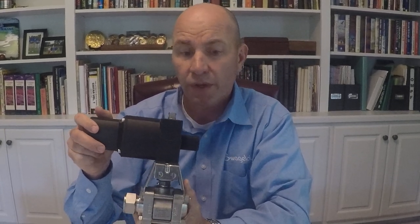Other options include a full range of pneumatic and electric actuators that enable remote actuation as well as position indication. This is the Swagelok actuator already assembled to a one-inch valve. But if your system or facility is standard on an ISO 5211 compliant actuator, we can offer our valves pre-configured and assembled with those ISO 5211 compliant actuators as well.